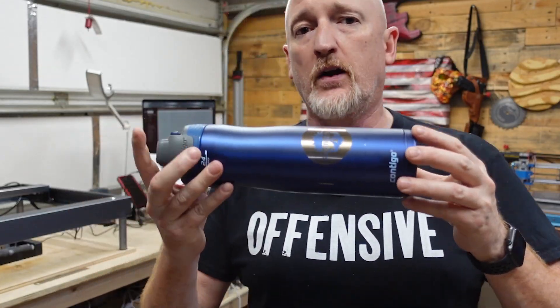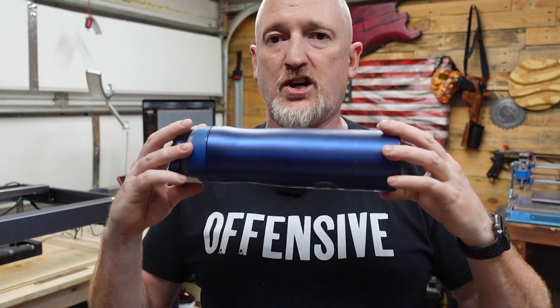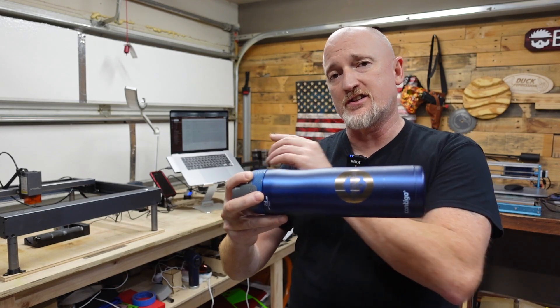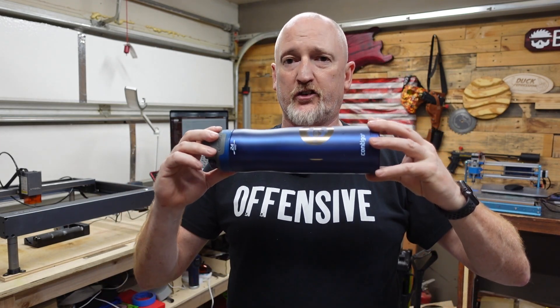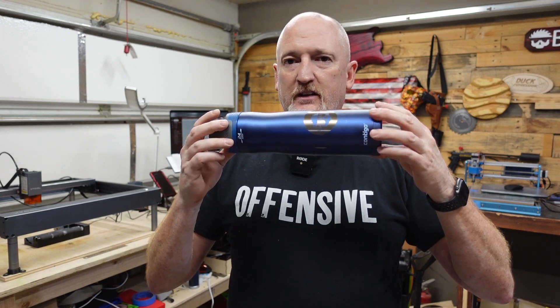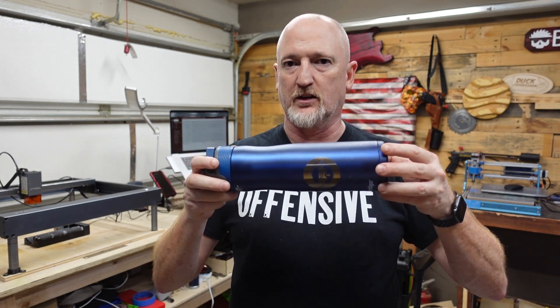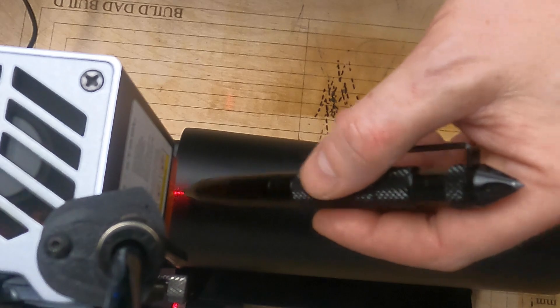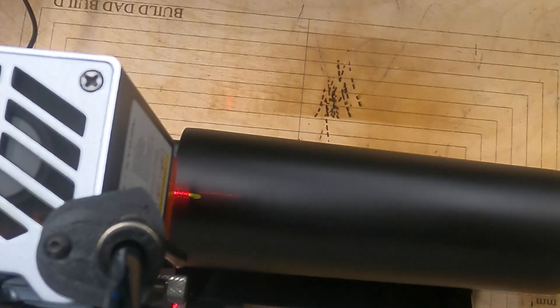Let me demonstrate. You have something on your rotary and it's running fairly slow when it's cutting, but when it's jogging back and forth, it goes faster. I'll show you how to turn this down in LaserBox in just a second. But basically what ends up happening is when it spins back, it's going to overshoot and jog a little bit. For demonstration purposes, I have a 20-ounce black tumbler on the rotary. We've lined up the yellow mark to the laser crosshairs on the X-Tool.